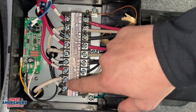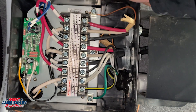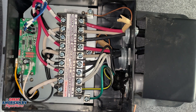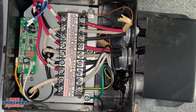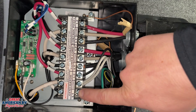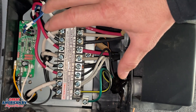Now automatically, if you had the generator and power cord both on, generally it's going to come from the power cord source. Once you unplug it, it will automatically kick over to the generator. And that goes regardless of what power source you're going from one to the other. This is all 100% automatic and will choose the power source on its own. So if you're ever having an issue where you are running your generator and it's not kicking over and you're not having any power, number one, you want to check your breakers at the generator itself. And from there you can apply a multimeter, make sure we're getting generator power here, and apply the multimeter here to make sure it is actually transferring over and that the relays aren't stuck.